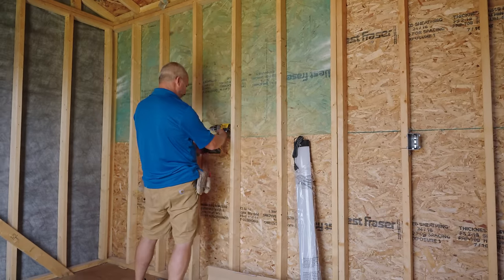All right, now. We're only using one screw on each side here. And as long as the brass tabs are connected, either one of these plugs will be powered up, all right? If you want to isolate it, then you just break the tab off. But we don't generally do that anymore. Okay, there we go, nice and long. Now we have neutral.